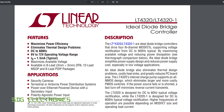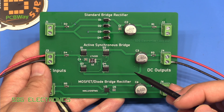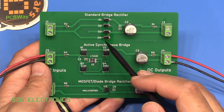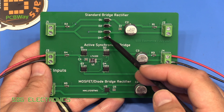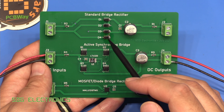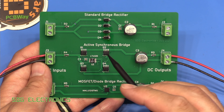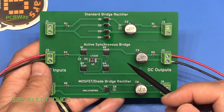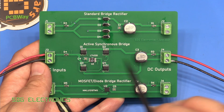You could potentially realize your own design operating at higher frequencies — if you design a charge pump with local storage that operates continuously, you could trigger MOSFET gates at much higher frequencies. Regarding this bridge rectifier PCB, we could swap the rectifier diodes for Schottky diodes, but similar to the hybrid chip they have limitations: they don't come in versions with particularly high reverse breakdown voltages, so they couldn't be used on the mains side of an AC-to-DC converter.